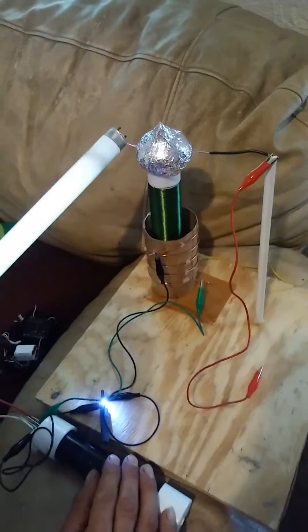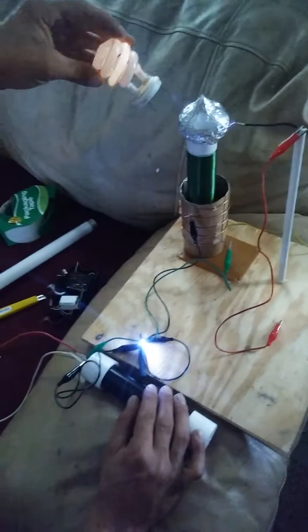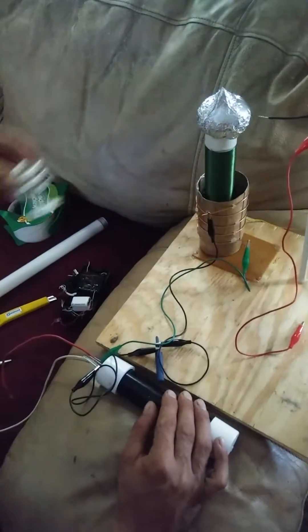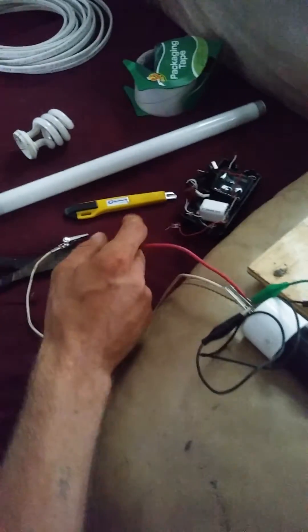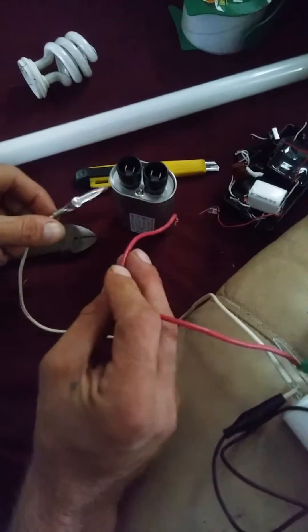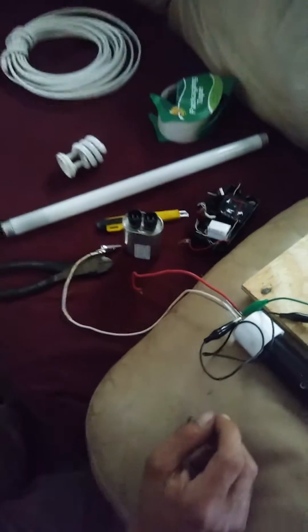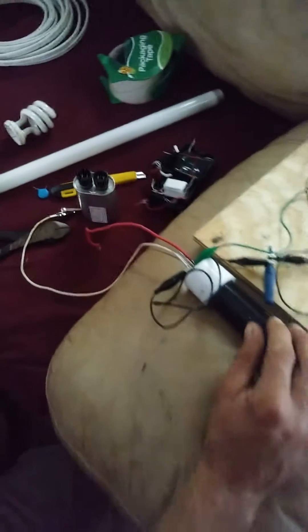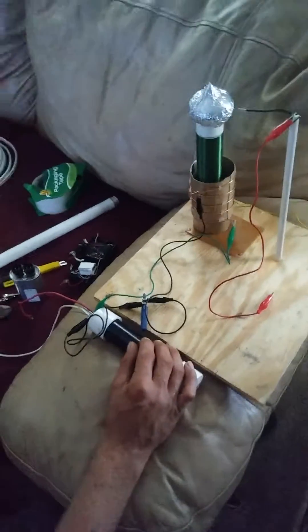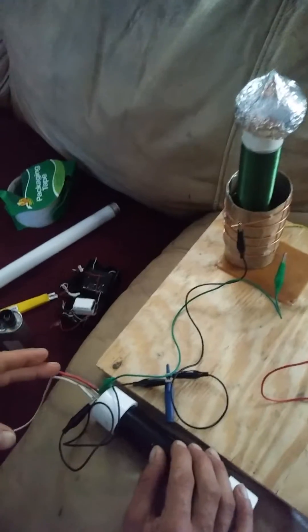So they light up other stuff. Let's see if I can get it to light up. I've got these extra leads here that I was using to hook up a capacitor, because on the circuit it says you should have a capacitor on there. But I tried using those and a couple of these other high voltage capacitors, some of these in series, and it seems like I get the best results without one. Not sure if there's a capacitor in the boost converter — I think there is, actually, because I touched it within a short amount of time after using it and got a little shock one time.